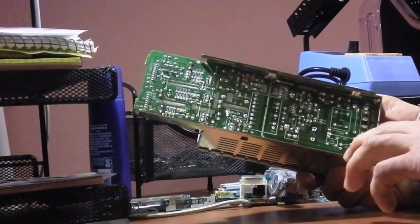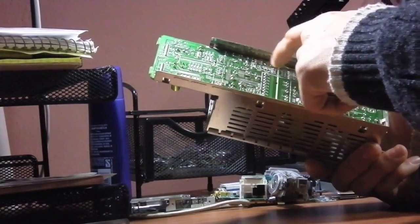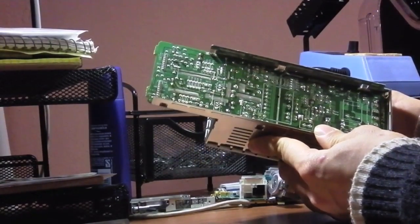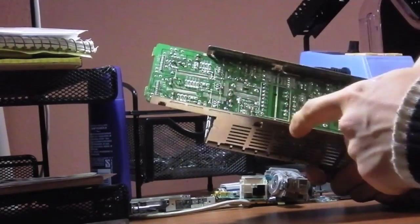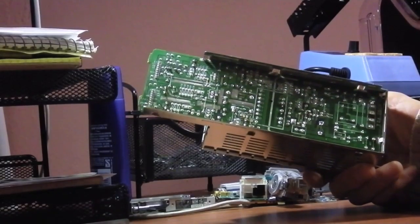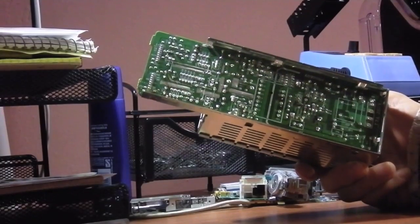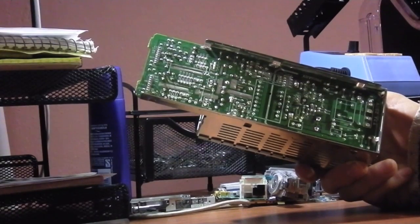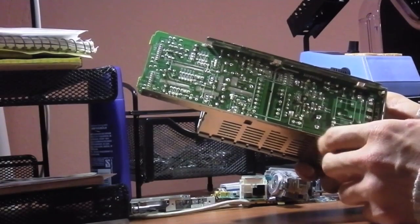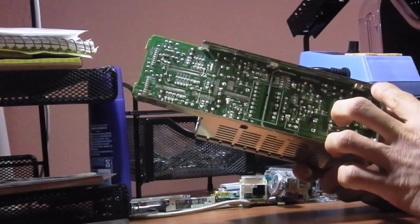You will see here we have several tabs — eight in total. These eight tabs are soldered onto the metal pads on the edge of the PCB, and there are two reasons for this. First, they are used to fasten the metal case onto the PCB and make sure it's more secure. But there's another reason, which is to allow the electronic circuit and the electrical path to use the metal case as a ground connection.